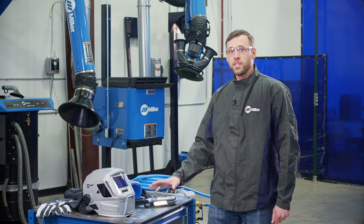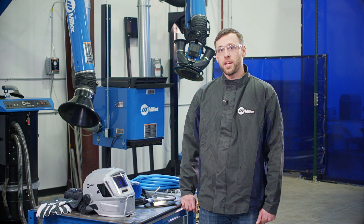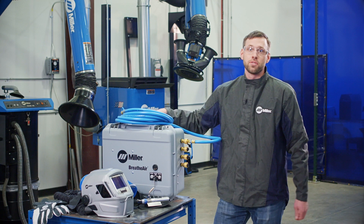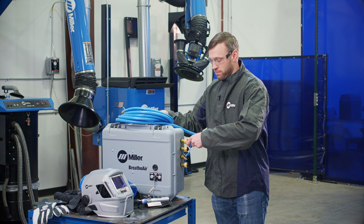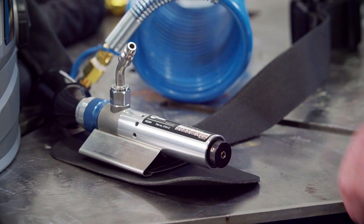In addition to regulating the Grade D breathing air, the C50 can also cool air entering the hood by up to 50 degrees Fahrenheit. The hose comes in both a coiled or straight model. You'll want to inspect the full hose to be sure there aren't any tears or worn spots, and that the fittings are tight. The Miller Breathe Air Filtration System is available in either a box or panel configuration and can be used to supply filtered air to the SAR system. To connect the hose to the box or panel, insert the male end of the hose into the quick connect fitting. Ensure your line pressure meets your SAR system configuration, which is provided in the owner's manual or product spec sheet. Any airflow in the head assembly can be adjusted using the knob on the C50 air regulator.